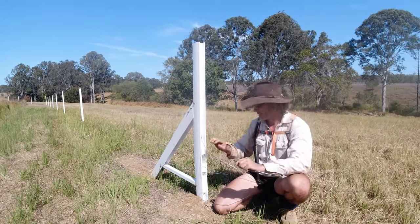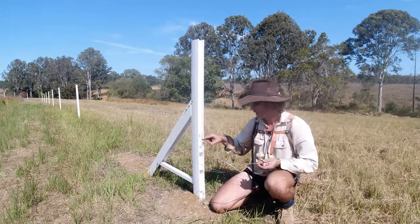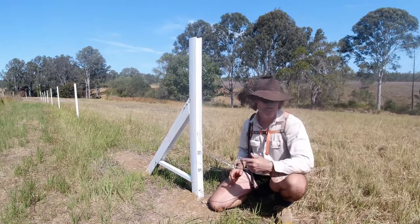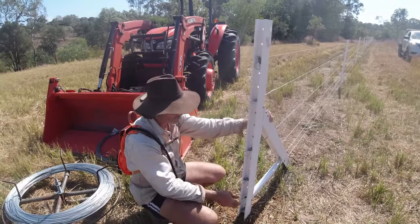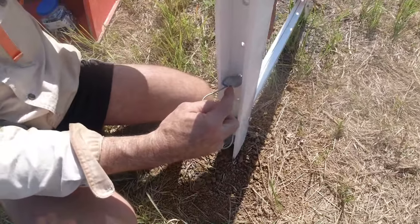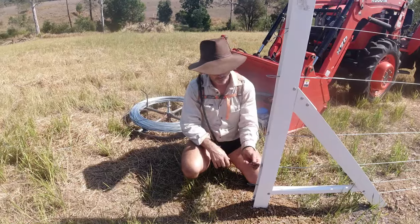I do the same at the other end because I know it'll be slack going through that gully. You may be asking why I've got such a long piece here - that'd be a foot and a half. The reason being is I'm putting a spring gate here. One thing good about the gripple is it's got two holes - it's a joiner. You can have two bits of wire going through and grip on the middle and tension both wires. That bit of loose wire just comes back through the other hole in the gripple, and I'll twirl the excess along the back. That enables me to put my spring gate here and the other handle goes in the other loop at the other end.